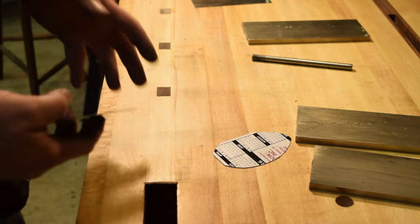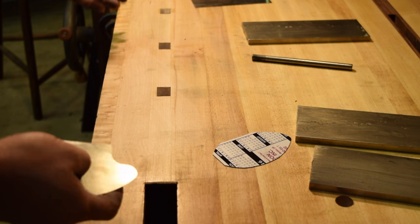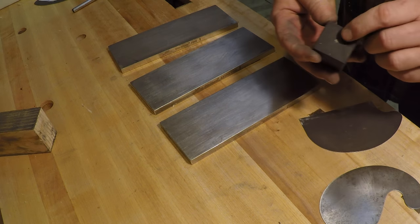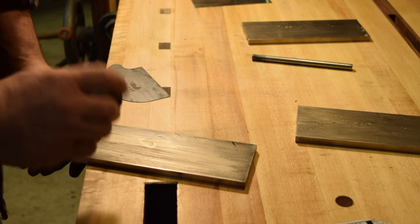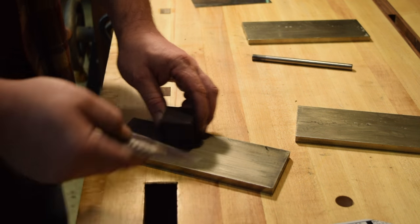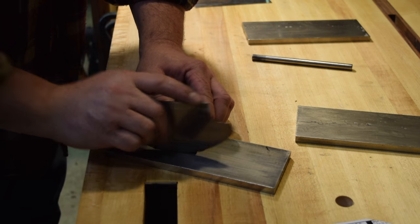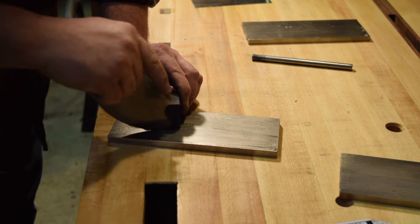A lot of times when I needed to re-sharpen, the piece I was working on was already in the vise, so I'd have to take it out, put the stone in, and swap through progressive grits. It's a great method, but what I found works better for me is this little cube. It has eighth-inch super magnets in it that lock down onto the stone and hold the card scraper at 90 degrees to the work. Then I can sharpen all those rounds without fear of it going off angle, working through progressive grits just like I would on the rectilinear scraper.